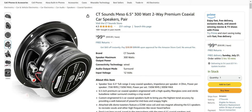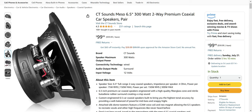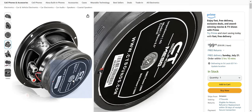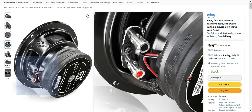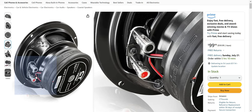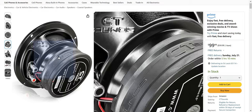First of all, they look really good. A couple of things I want to point out — look at those nice grills. You notice in the back of the driver you have a screw here, and it's exposed with the label out, so you can get to it without tearing the label up, which is cool. Nice heavy wire on that going to that tweeter. You can easily get to that and rewire that tweeter to be separate. It's got the spring binding post, so you're not fighting with the blade terminals — that's a good thing.